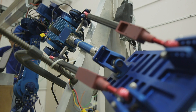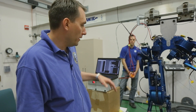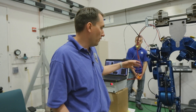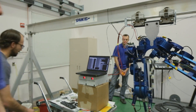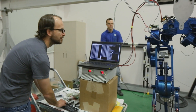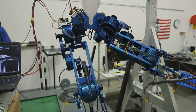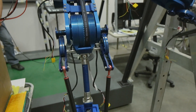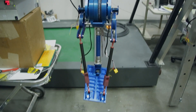Right now we're just trying to establish a baseline with simple robotics practices — efficient motors, efficient transmissions — to see the best we can do. One nice feature we've discovered is that it's very quiet because we have smooth control over the motors and very efficient transmissions. Right now we're just powering two joints, two of the hip joints. The other ones are just along for the ride, so everything the knee and ankles are doing is just floating for the moment. We have our first version of electronics up on top, and so far everything is behaving just how we want it to.